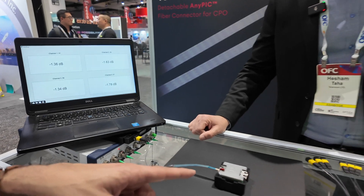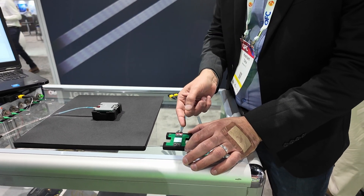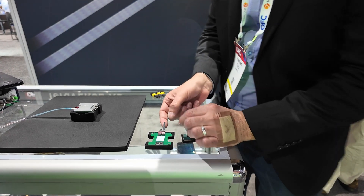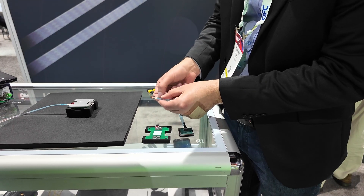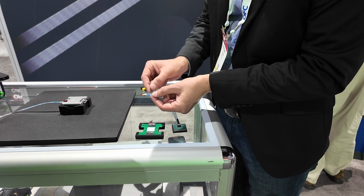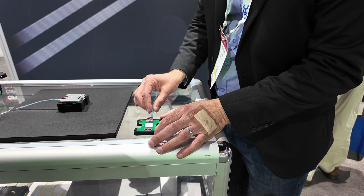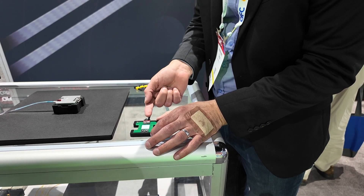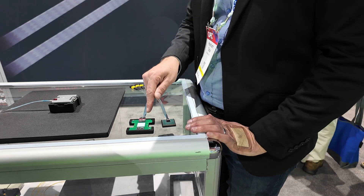Fantastic. So this is the first stage — what's afterwards? Our customers are looking for shoreline density with the ultimate large number of fibers. So we came with this generation with a slimmer form factor, again optimized for co-packaged optics applications. This is a much thinner, slimmer, 32-fiber, 127 micron pitch connector. This one maintains larger distance and larger area for thermal cooling. It's an inject and eject from the side — just like USB, click in and click out to establish connectivity.